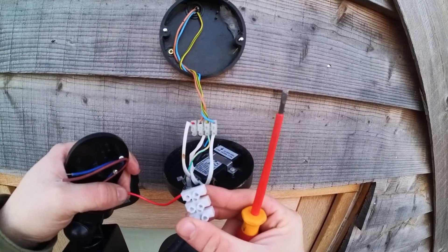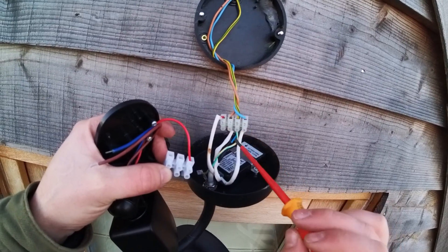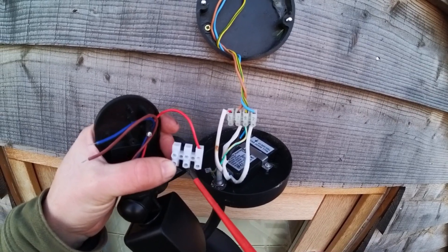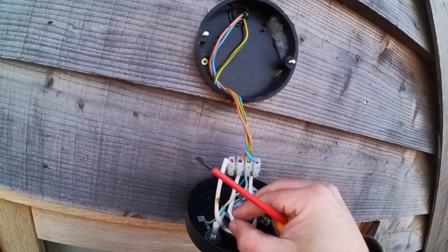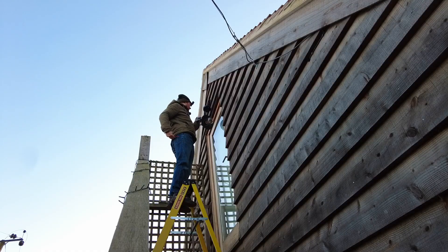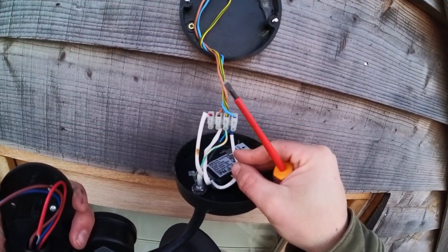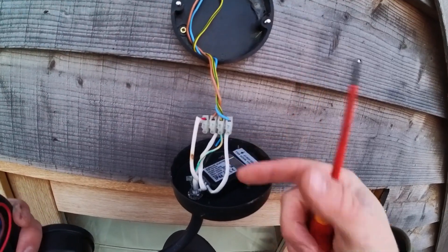What I'm going to do is match this really. I need an earthing block, so I need to connect up my earths with a wago. My live is going to come in there. Oh no, that says earth - that's stupid. Right, on my sensor: I've got a blue there, a live there, and then a switch there. So that's all three wires. I just need to swap them three wires over.